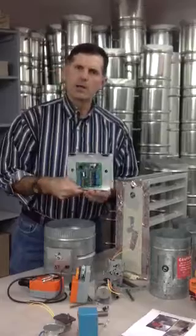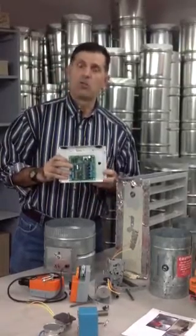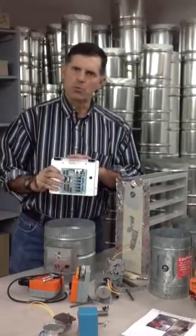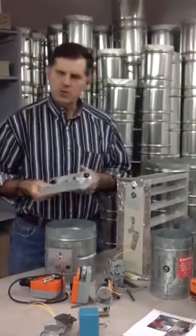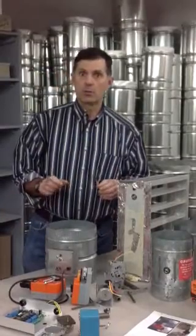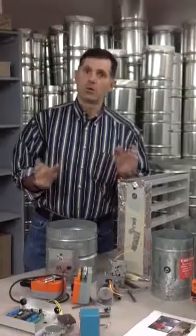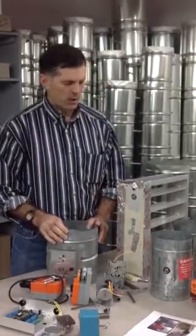If you'd like, go ahead and take a picture of your zone control board so I can see what you have and I can see the wiring — and usually it's very easy at that point. If you can physically get a third wire from the zone control board to the damper, it's usually very easy to add. And by the way, you might look and see what wire's already been run, because very often there'll be an extra one or two conductors in the wire that's already there — you don't have to run any extra wire, you just have to hook one up.